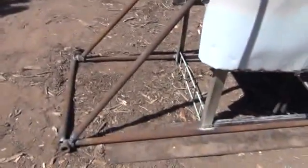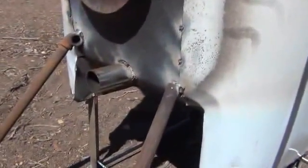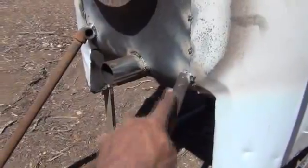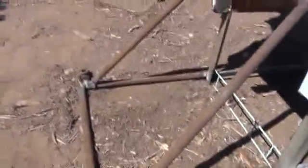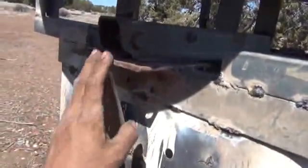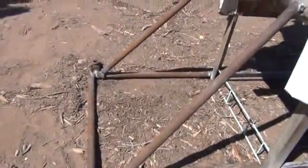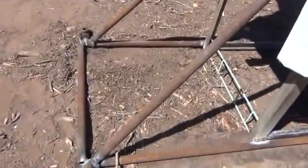Just a quick addition to the frame here at the lower section — I've put some steel pipe welded from the very front legs to the secondary legs and all the way back out here. These are slightly angled inwards, giving us more of a centered focus going to the outside. Most of the mass is actually distributed right here in the center when we pull this barrel out, so the center mass is focused and spread out a little bit. That'll help us when we pull the barrel out of the stove and fill it full of wood, giving us a lot more support.